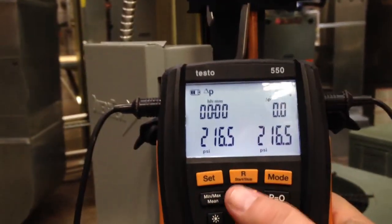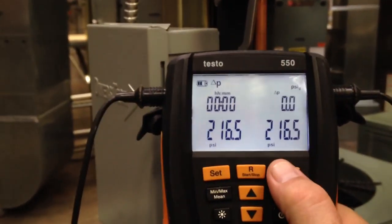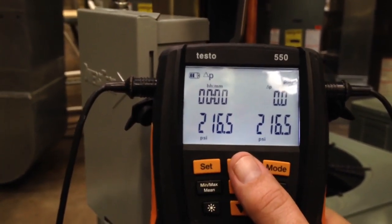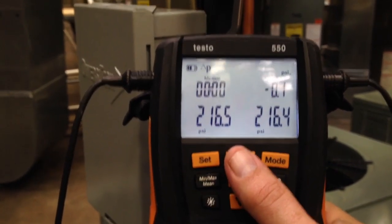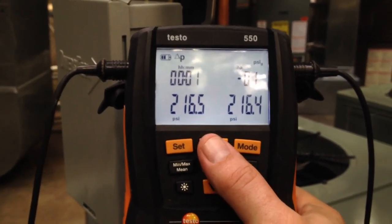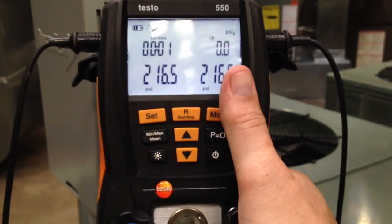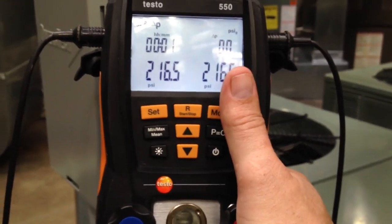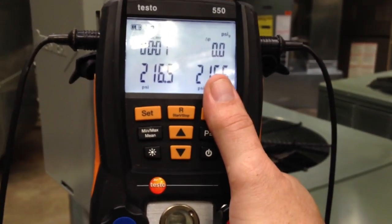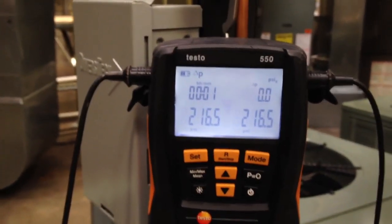Really all you have to do is go to the mode key to get this started up, press start, and then it's going to continue to flash. In a couple of seconds we should get a 1 up there, meaning it's gone through one minute of time elapsed. This uses Boyle's Law to determine that. When I push stop, it's going to show me my final pressure, my measured temperature, and a drop. Now, if this had changed in temperature — like if it had gotten hotter — it should have also increased in pressure, and if the pressure had not changed, it would actually indicate a leak, because it knows that nitrogen would change in pressure with a corresponding change in temperature.